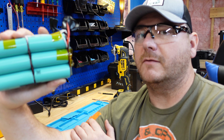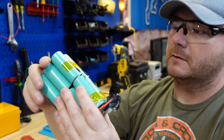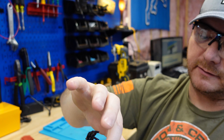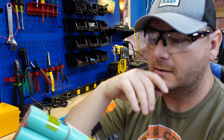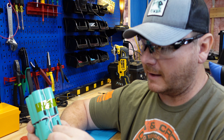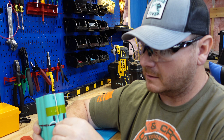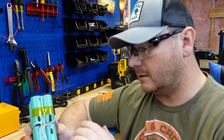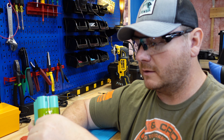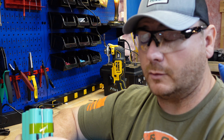Stick around to the end of the video — I'll do that freezer test at the end here. Now let's talk about what I don't like: these balance leads are all crisscrossing and I don't like that. You really want those balance leads separated out — you don't want there to be any chance of shorting.